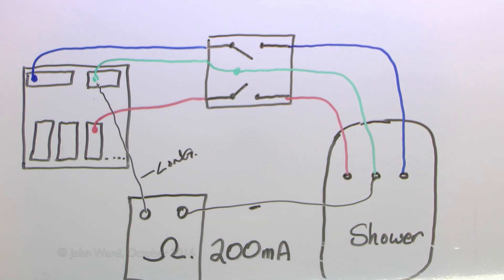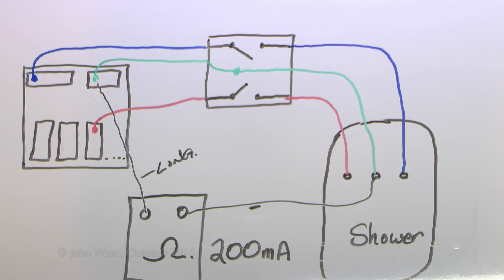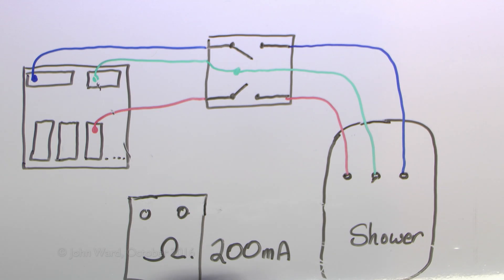That's the most simple and obvious way but it does involve a rather long wire - you can either make that up from a length of cable or you can buy big rolls of test leads which have the appropriate plugs on the ends for the meter you're using. There is another way, and that's probably the most common way used on smaller installations, and that involves using the line conductor as part of the test circuit rather than having long test leads trailing all over the building.